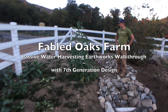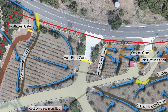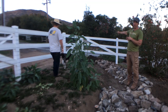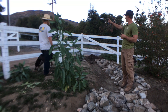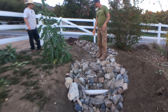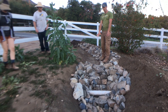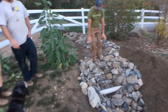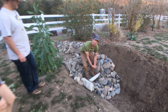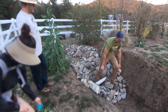We'll talk through it element by element. This is the northwest corner of the property. What we're looking at here is what we're calling the run-on drain. This is Carancho Road, and with about four or five sandbags we'll be able to shunt water that would otherwise run down this road and be deposited in the creek onto the land via this five percent drain. That drops into a little splash pool — a dissipation pool — so water will spill over this sill, drop down into the bottom where it'll drop its sediment. Still water will take the energy out of the fast-moving water and it'll transition over this lip smoothly and passively.